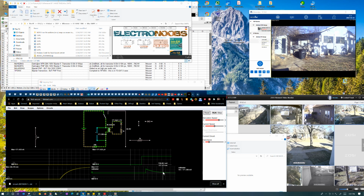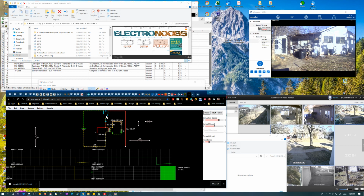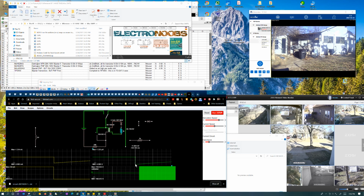At any rate, it does look like a standard charge curve, right? In other words, it looks like the inductor is charging like normal, like you'd expect. Okay, now, if you switch polarity, it should have the same amount of energy it would have had in it before. There's no reason it shouldn't. So let's let that discharge, because now the polarity is reversed. But it's at 5 volts and 5 milliamps. Yet I know it's got the same energy in it, and you would think it would be trying to draw the same current. So I don't understand this one bit. That really doesn't make much sense.